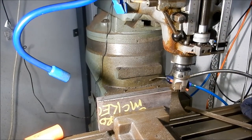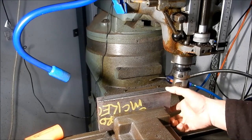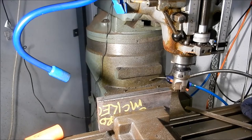I've spent a bit of time lubricating the machine up because it hasn't run for a couple of months — that's important. If you haven't run a machine for a while, just go over it, have an eyeball, get everything oiled and greased that needs to be done, otherwise you'll see some grief down the track. With this bit of stock I'm going to machine them out to finish size — the two stocks measure 88 in depth, 210 in length and 23 in width, so we'll get both of these knocked out to size so we can start machining in the features.